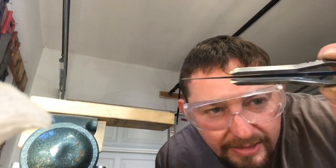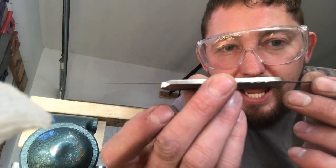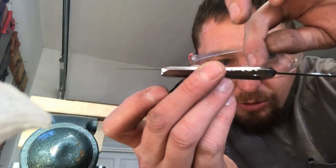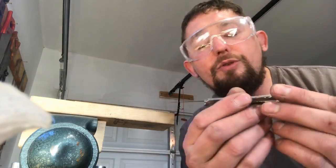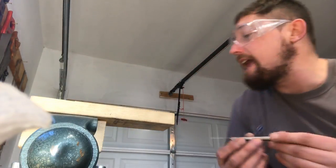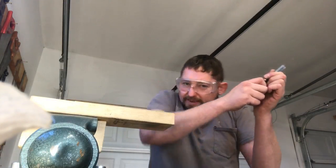See what we got. In this respect here, I'm doing pretty good. But in the respect I'm not doing good, look at it on this plane. I'm about far enough in back, but I need to take more off of the front, because my reed is pitching uphill. I don't want it to pitch uphill. I'm going to stop right before I'm sitting even with the frames, and I'm going to have to do some adjustment. One thing I've learned, when you're trying to get your reed out, don't grab a hold of it and pull like this.